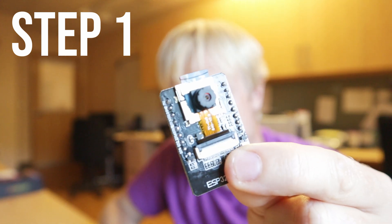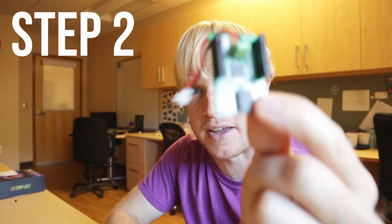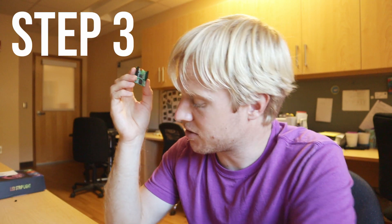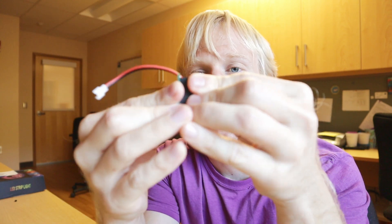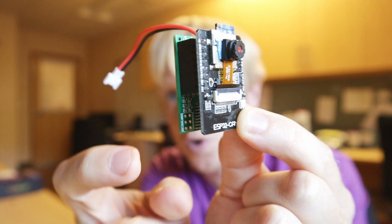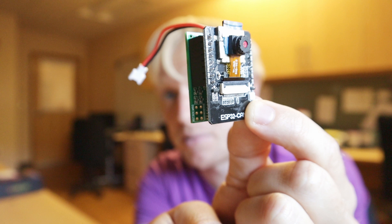So I've told you that I have a working prototype of KeloCam, but I haven't told you how it works. Well, let's do that. Step one is to program the ESP32 cam board to take a photo any time power is reset, and to store that photo in the memory card. Step two is to program KeloCam — both of these get programmed in the Arduino IDE — and basically you program KeloCam to take a photo at certain intervals. You could tell it to wait a month, then wake up and take a photo every minute, or every hour, or every 30 seconds, or every day — whatever you want. Step three is to take your KeloCam and hook it up to the ESP32 cam board. As a complete package, the KeloCam board on the back controls the flow of electricity to the ESP32 cam board on the front. When it's not taking a photo, the board in the front has no power supplied to it, so we have completely negated all of those power consumption issues.